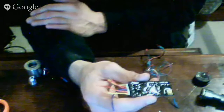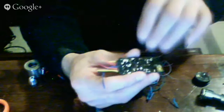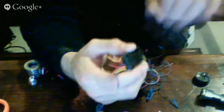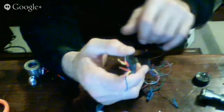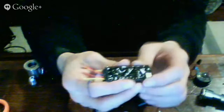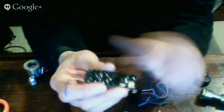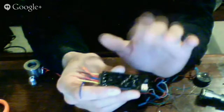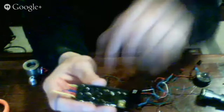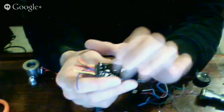The RICE port is what you use when you don't want to take that SD card out — it connects directly to the computer through a specialized RICE cable, which is essentially an eighth-inch jack to USB. The Obsidian does have a mini USB port. Once connected to the computer, you upload sounds to the board and can set clash settings and swing settings. This board does an alternating lockup between the two LED diodes you have wired — in this case I had red, blue, and white on my RGB, which made purple with a white flash. That was my violet-amethyst saber.